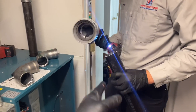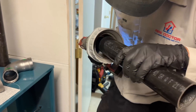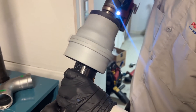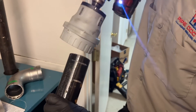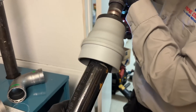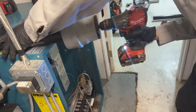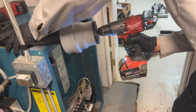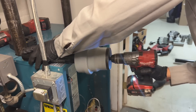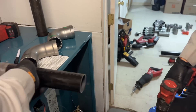Now that Peter has cut the 12-inch piece, we're going to prepare this pipe. Just shove it in there, push against it — there you go, stop. Now try to get the side with the sandpaper. Put it there where you have a nice even surface, and go around with the drill and the tool on it — try to get all that paint off. All the way around, nice and neat. Let's do the other side.